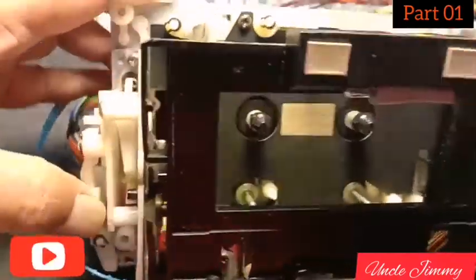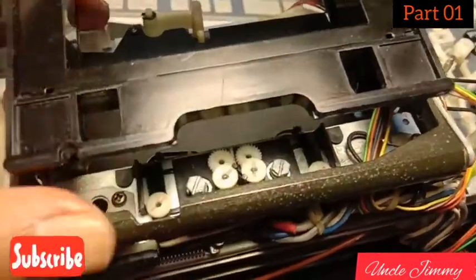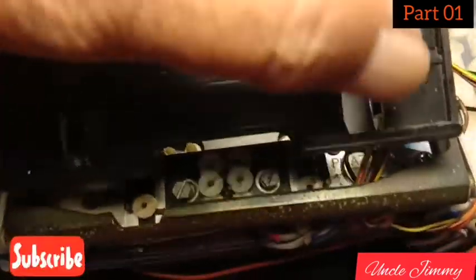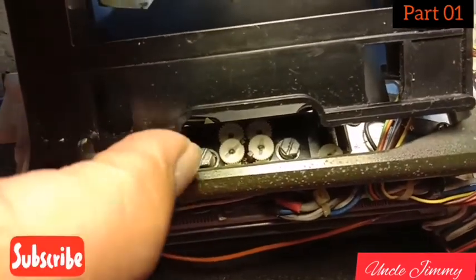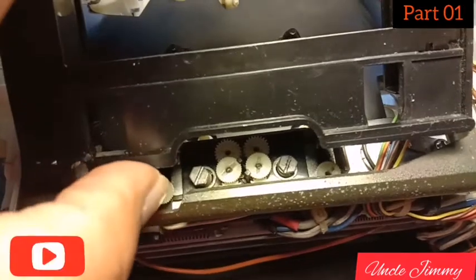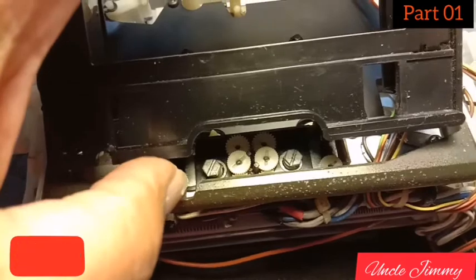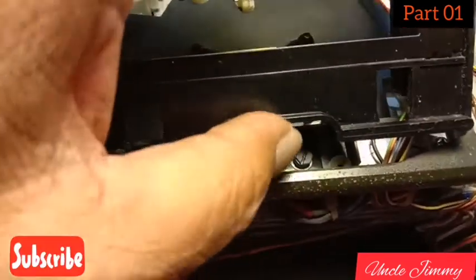The other work — we are actually waiting for a set of azimuth gears. I was fearing because I saw one that was broken, which is the playhead azimuth gear on the bottom right here — that was broken. I've checked the rest of it, and the height gears and other screws were okay, as is the record head azimuth screw and the other little ones at the back there.